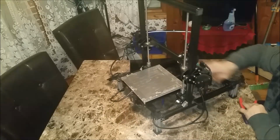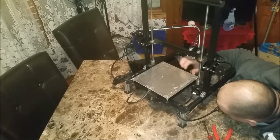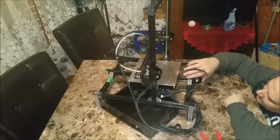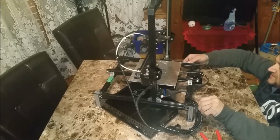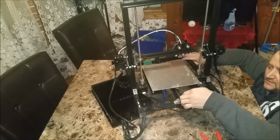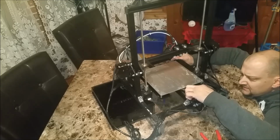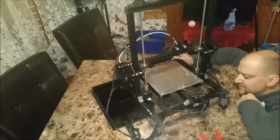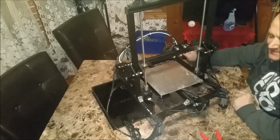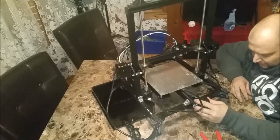So I'm not hitting my end stop switch. Here, what am I hitting? That's stopping me from going further. I'm hitting my bracket. I'm hitting right here. That sucks. So this stupid angle right here is causing me to lose 5 mil. That extra 5 millimeter right there, maybe 5 to 10. I suppose I could Dremel that out, but I risk cracking that acrylic.